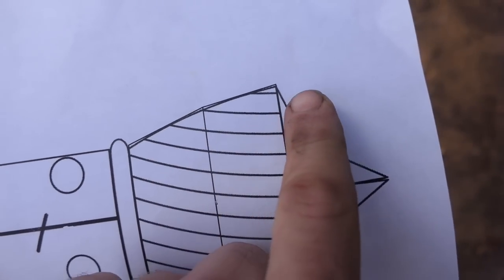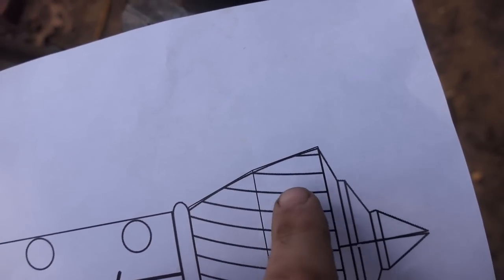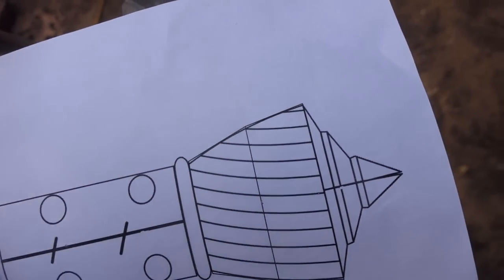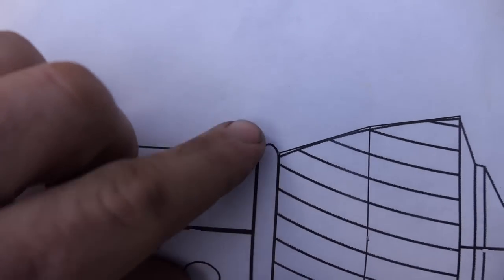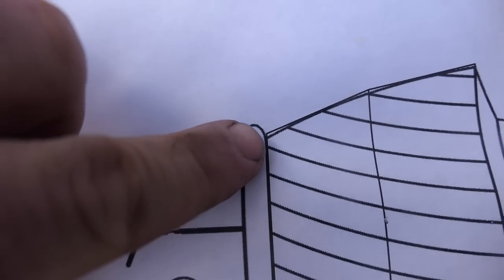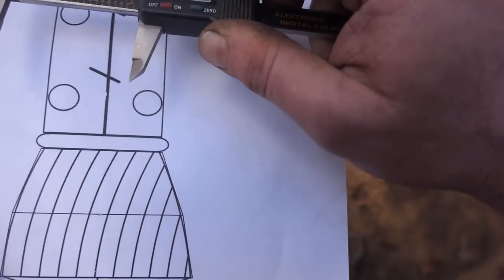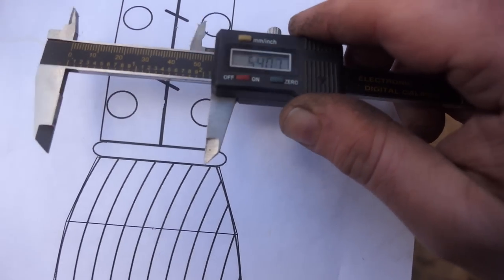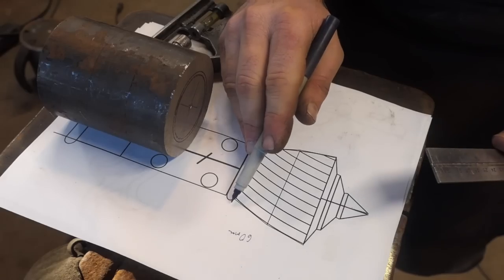So I went inside and I drew these lines on top because of the curve of the pommel, which will be kind of weird anyway because I'm grinding all these ferrule groove type things into it. As you can see it's practically nothing, but I do have to make an adjustment up here where the circle is now too small. Because of the curve, it's actually a little bit bigger — like instead of being 2 inches, this guy at the top is like 54mm instead of 50mm. So it's just a little bit of a thing. We're grinding this cone first.